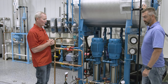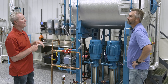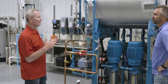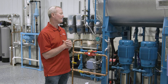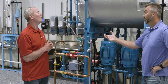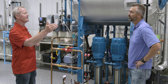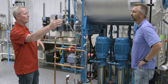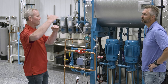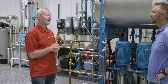It's obviously a pressurized tank, run between five and seven PSI continually. There's a control valve and a sensor to keep that pressure on the DA tank, which runs at about 225 to 227 degrees Fahrenheit. So it's not only taking oxygen out of the water but also preheating the water for the boiler. That keeps from shocking the boiler and reduces the load on it — the higher the input temperature, the less the boiler has to work to reach the outlet temperature.